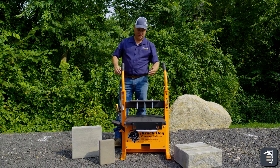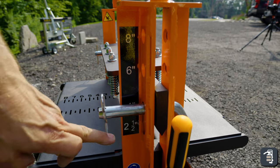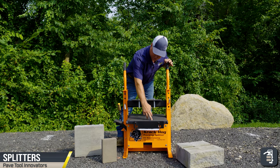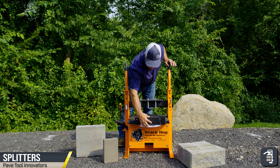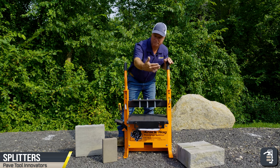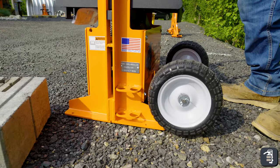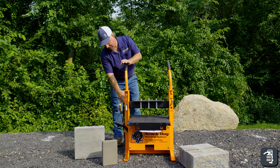The Cracker Splitter is a great option whether you're doing pavers, slabs, or wall block. The height it'll split is 8 inches and it opens up to 16 inches. A couple of nice features: it has your dimensions built into the plate so it tells you what your splitting depths are. It has a stopper plate that you can lock into place — just slide it up and over — so if you split something it doesn't shoot the product off and possibly damage the pavers you're working on. It also has nice off-road, larger wheels for wheeling it across your job site easily.